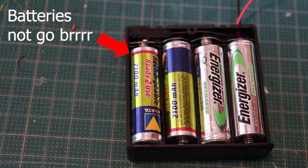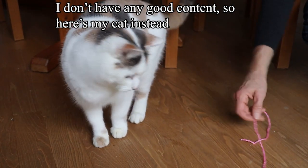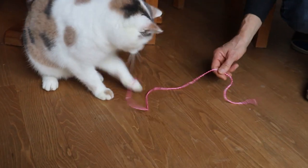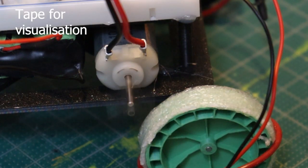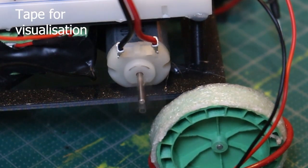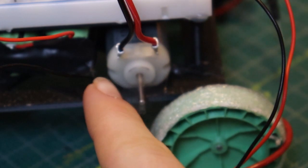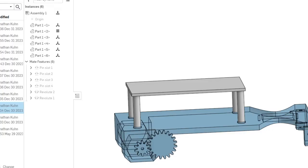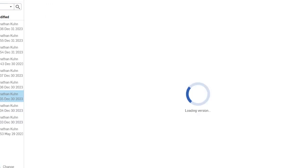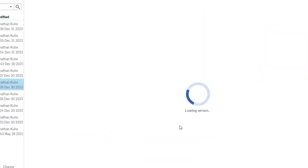Because I had no idea how strong and how fast the motors were, and how weak 4 AA batteries are, I completely overestimated how much the motors could push. Adding to that, the motors also were way too fast. I then tried to reduce the motor speed, both with gears and rubber rings, until I got to about a 1:20 reduction, at which point the wheels were rotating at the right speed.